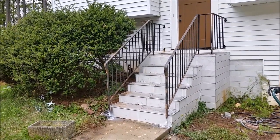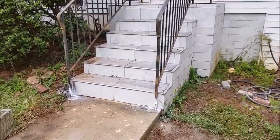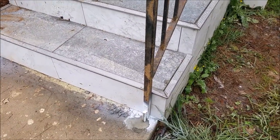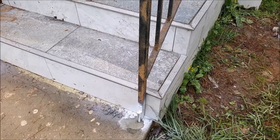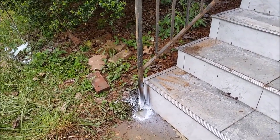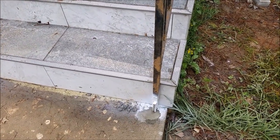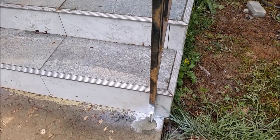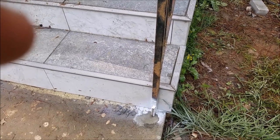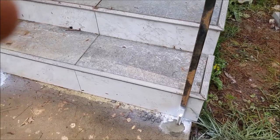The job is finished. I just want to say a couple of things: here we have a special situation so we need to put a rod inside this hole, in both cases here. This kind of concrete that we pour inside the holes takes about one hour to get hardened, but it's really nice to leave it for 24 hours. That's the anchoring cement that we put here.